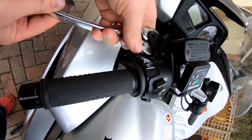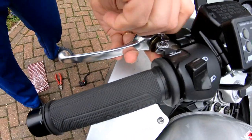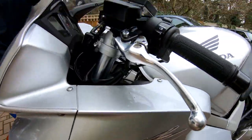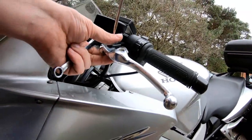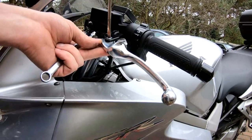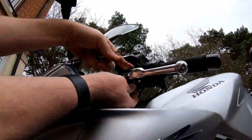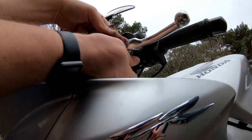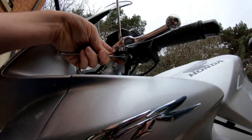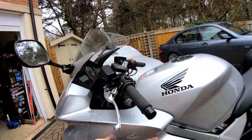There we are, just like that. Then pop the pin in place like that. A couple of turns and it will engage in the housing on the other side using the screwdriver. Bring this pin all the way home, and then secure with the nut on the other side. Screw up to touch, hold the pin in position, and simply tighten the nut. And there is the lever installed, just as it should be.